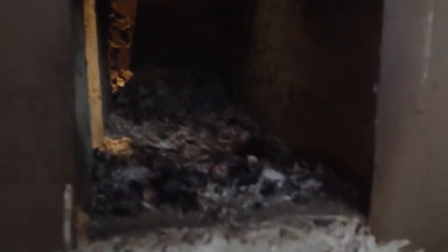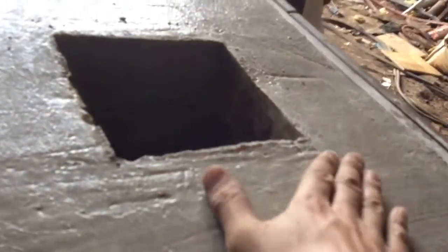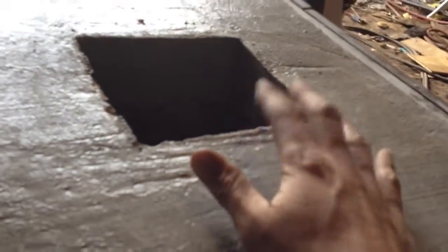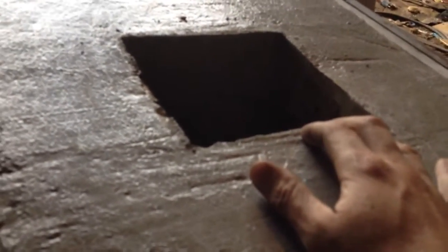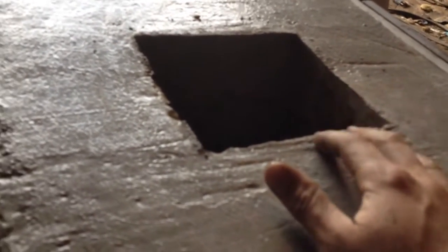This is the front port. Now that the wood is burnt out, you can see there's some ashes here, and that's to be expected. I'm glad I made this a little bit oversized. I think my last one was five inches, and this one is six inches — six and a half wide by six. I wanted a bigger feed port, not like a batch box, but something a little bit bigger, and room for ashes too, because ashes can choke up your stove. With a bigger burn chamber, there's room for ashes.